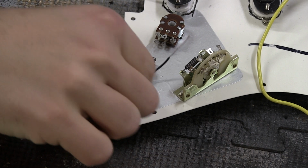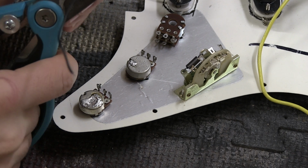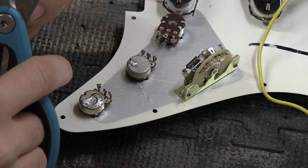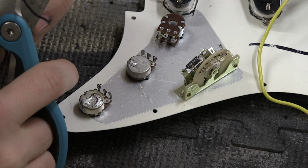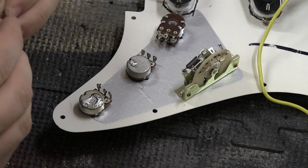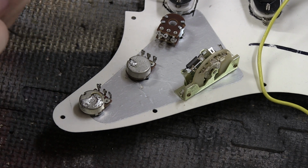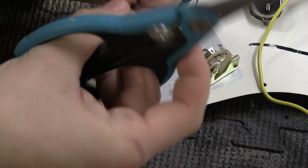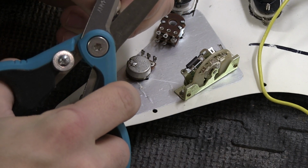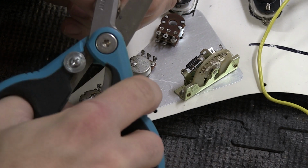And all I'm going to do is take a scissor, and I'm going to try to cut away that piece. Now you can obviously do this with a bunch of smaller pieces, but I like to have one wire connect all 3 parts, because I think that makes everything look just a little bit nicer, and you don't need to have a bunch of wires going in all directions everywhere. And then I can fold the wire like this, and I cut alongside. Now you have to be careful so you don't cut the actual copper inside, because that's no good.